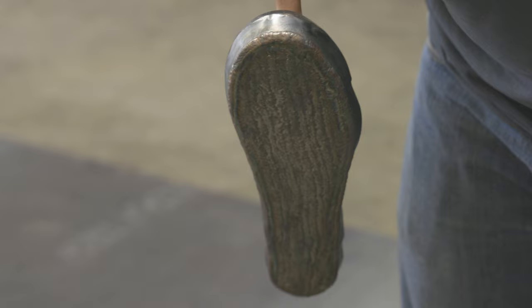I took one of these spring clips that hold your hitch pin in, cut the back of it off, flipped it around, and then welded it back on. It made a nice little piece of spring steel welded to the back that the strap hooks through nicely.